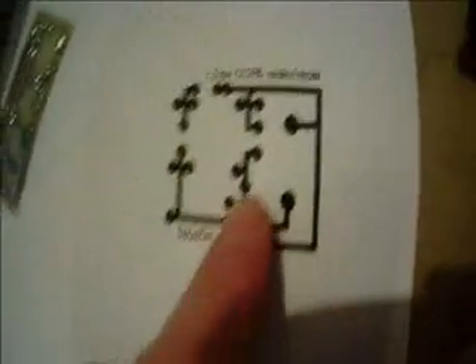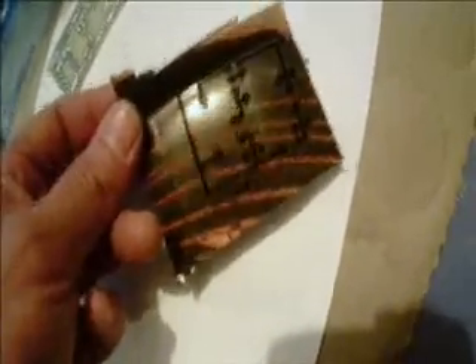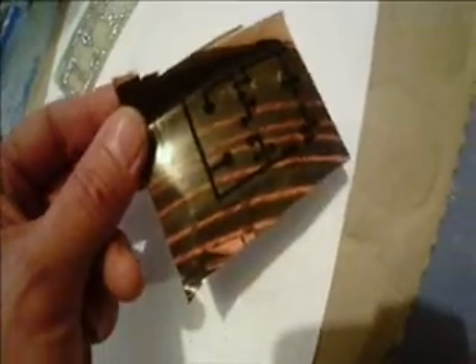So I drew that up in Microsoft Paint and inverted the image so that the words came out the wrong way. That was printed on an inkjet. Obviously inkjet doesn't work for toner — toner has a plastic in it. I read that using shiny magazine paper, as opposed to using proper press-and-peel or expensive transfer stuff, is doable. So I used some shiny magazine paper and got it tangled in the laser printer. I had to go digging to pull it out. After getting several bits tangled I gave up on trying to get one to spit out without bending.